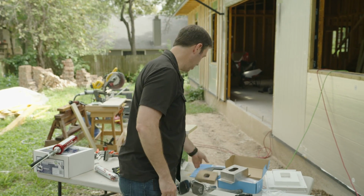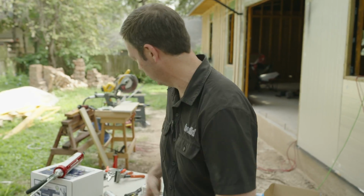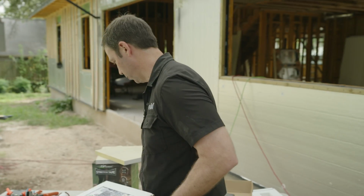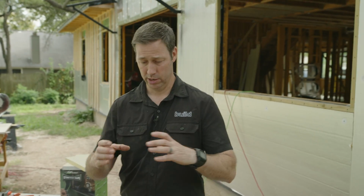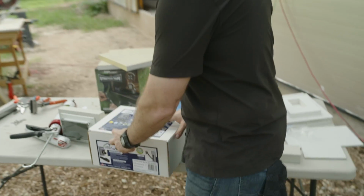All right, guys, I think that is it. Did I miss anything? Oh, I missed something. I forgot about my HVAC line sets. One more thing. Sorry, guys, long video, but lots of good nerdy information here. On the side of my house, where I've got my line sets coming through, very, very critical, as I said earlier, to make sure the HVAC guy doesn't group everything into one big hole. We want separate holes for those HVAC line sets coming through.